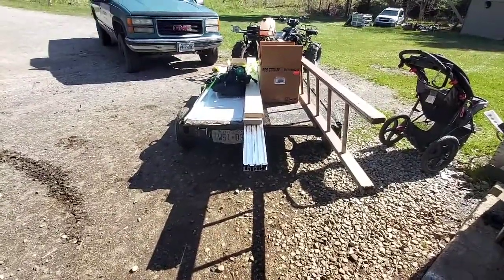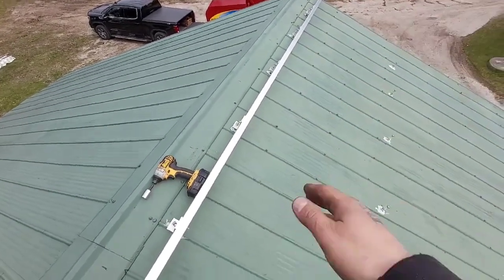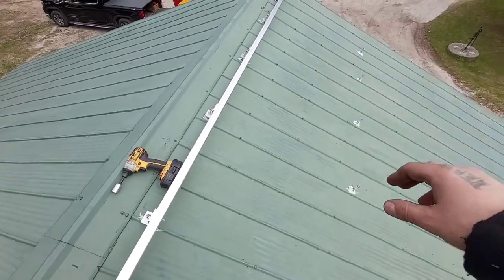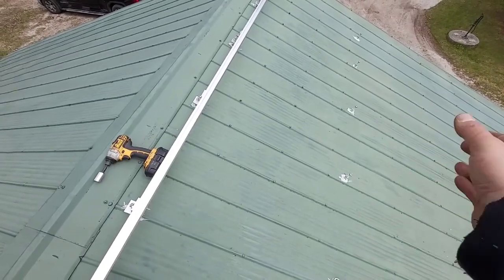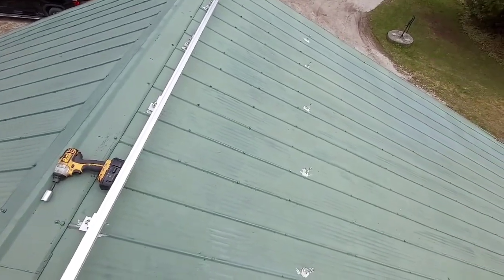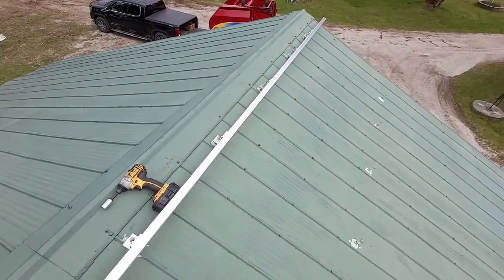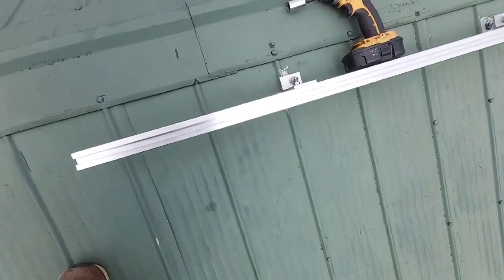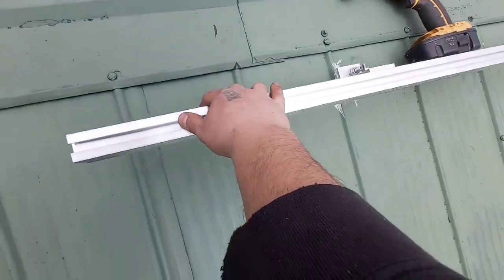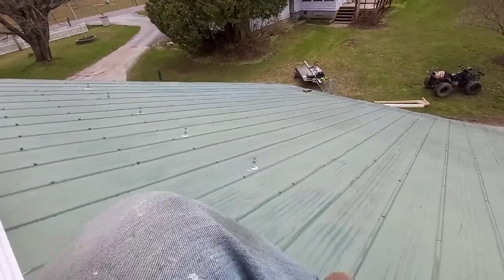Anyways, thanks guys. So got rail number 1 up, so we're going to go three this way, like vertical, and then 3 more underneath it. So these ones will actually be flipped upside down, and all the wiring will go through the middle. Pretty good. I got one that's a bit crooked, but it's very strong. I got it right into the studs, or like into the trusses. The roof is really slippery, just dirty or something. It's a little bit dirty.